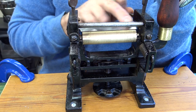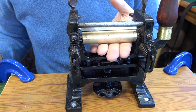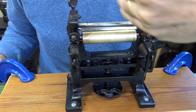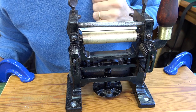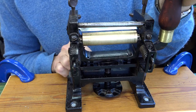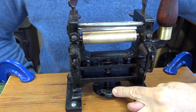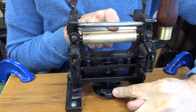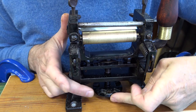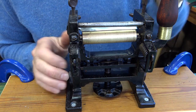The main part of the machine is the blade — this one has a four-inch blade. Underneath is the brass roller, which runs nicely. The bar in front is just a protection bar that stops you cutting your hands on the blade. There are a couple of springs to keep the roller nicely pressed against things, and at the bottom is an adjustment screw which changes the distance between the roller and the blade depending on the thickness of split or skive you want.